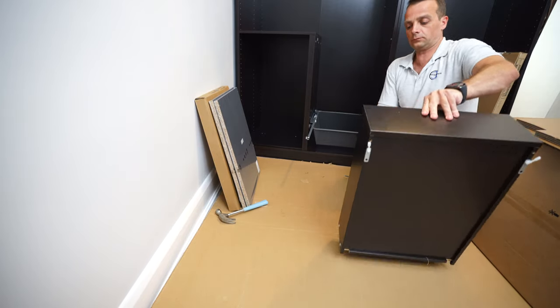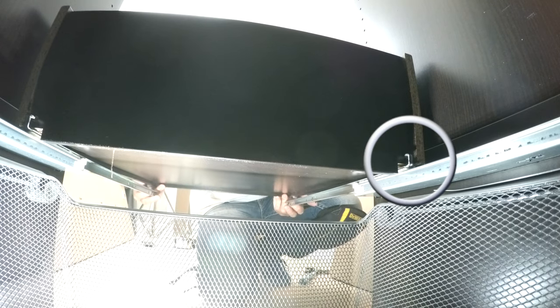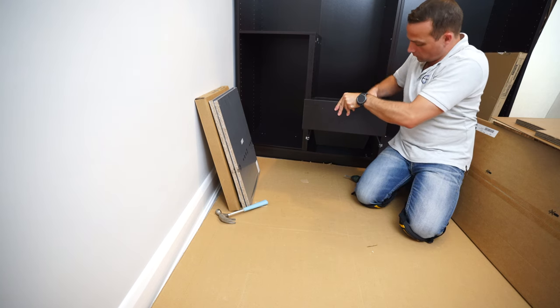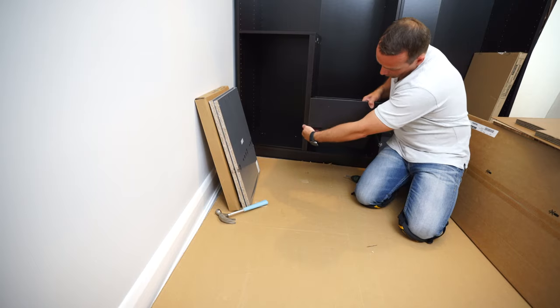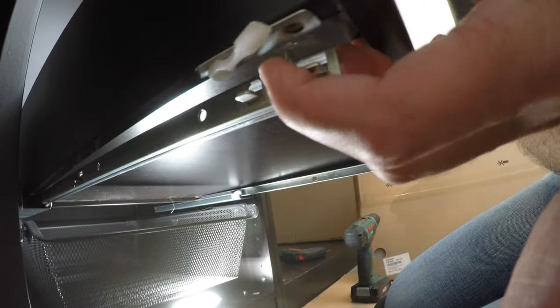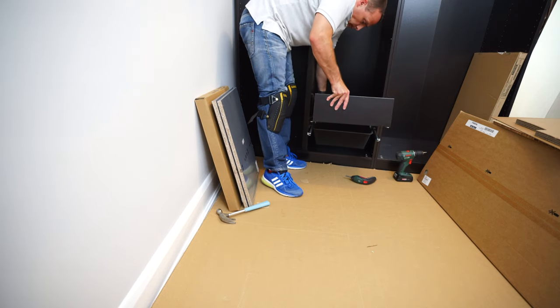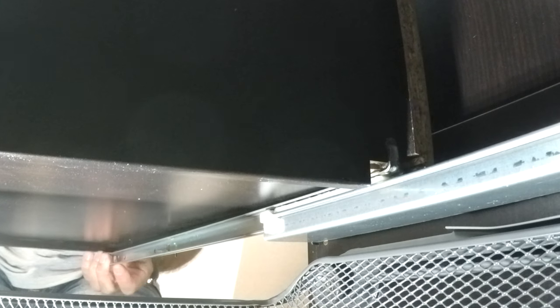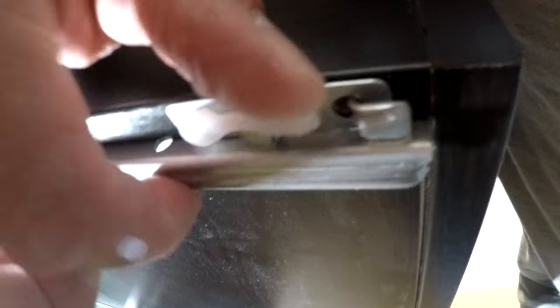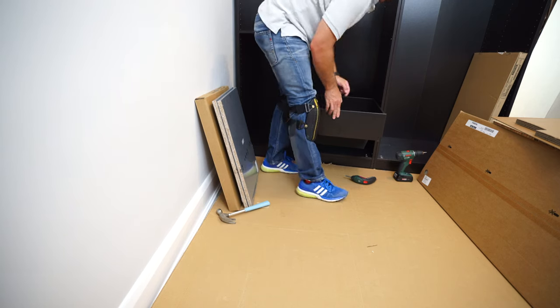Now you can open the rail and place the drawer in. There are two hooks at the back that have to pop into the back side of the drawer. If they're not in, you won't be able to place the drawer down at the front. Make sure the back is in and the front comes in nicely. If you have a problem, the back hook is probably not hooked - open it up again and push the hook in, then lock it at the front. Check the other side as well as sometimes it pops out. Secure the lock by twisting to the straight position. Exactly the same on the other side - once hooked in, place the plastic cover and it's all secured. Check for smooth movement in and out.